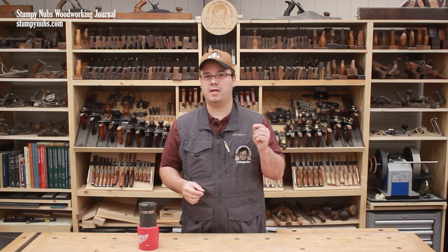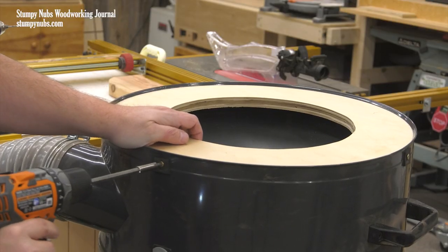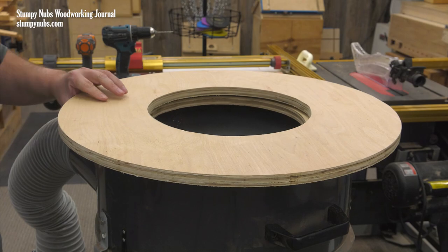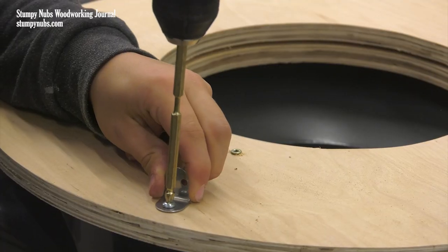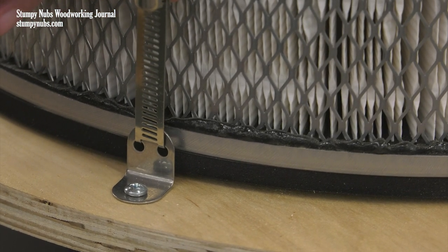Finally, what if your collector's drum is significantly smaller than the filter? In that case, I would install a plywood donut inside the rim, just as before, but then I would make a second, larger donut that may sit on top of the rim and anchor to the first one with screws. Don't forget to seal with silicone on the underside as well. This double donut or anchor donut setup will provide a large platform on which you can mount your larger filter with brackets and latches.